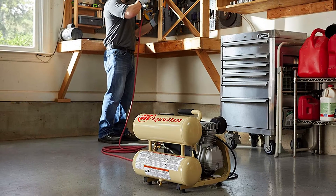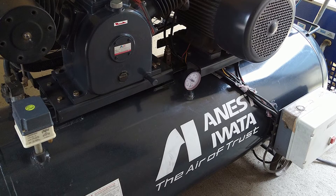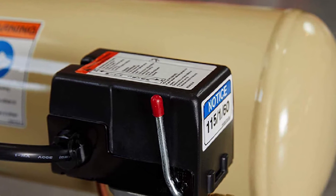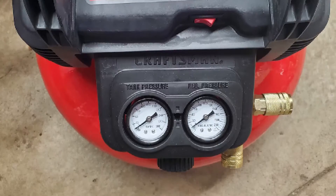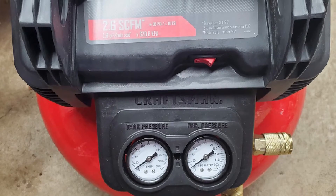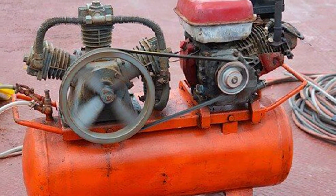Three types of pumps are used to compress the air. Reciprocating air compressors are the most common — these use one or two pistons to force air from the atmosphere into a tank in ever-increasing increments, and each stroke of the piston moves a small volume of air. The rotary screw air compressor uses a helical coil or spiral lobe oil-flooded screw to continuously force air into the tank. This method is generally used for high-volume, heavy-duty, gas-powered air compressors — the type of machine you'd see used by road-building crews.